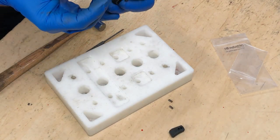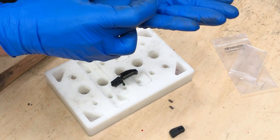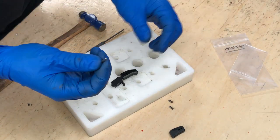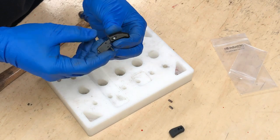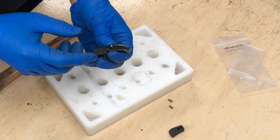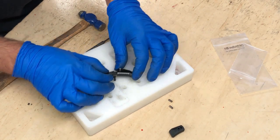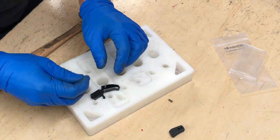That's where our taper pin is going to come into play. The taper pin — if you were to use calipers or look at it closely — you'll notice that one side is a larger diameter than the other side of the pin. So what we're going to do is drop the small diameter into either the front or the back roll pin hole, and let that align one of the two holes. This is just going to make it easier for us to drive the roll pin through and successfully get alignment instead of chasing two holes around.